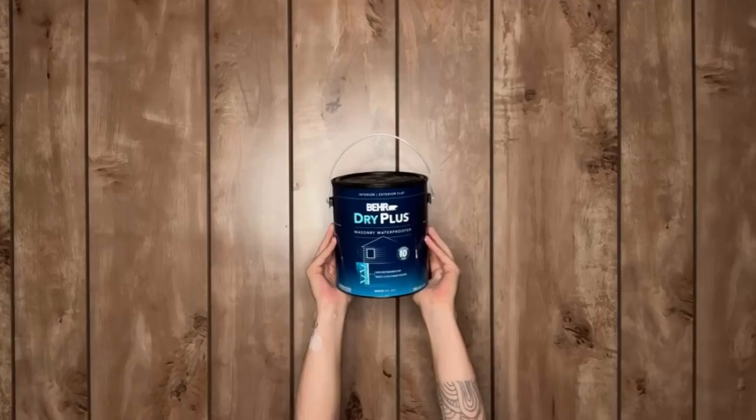It's been about a week since I did the mortar. I wanted to give it a little bit of time to really cure since it's getting colder outside, but I think at this point she's good to go. I just got back from the store with the goods. I originally thought I was going to be using a Drylok product, but since there's already paint on the walls down there I had to find a waterproofing paint that could go over existing paint. Behr has a product called Dry Plus, so hopefully that will do the trick.